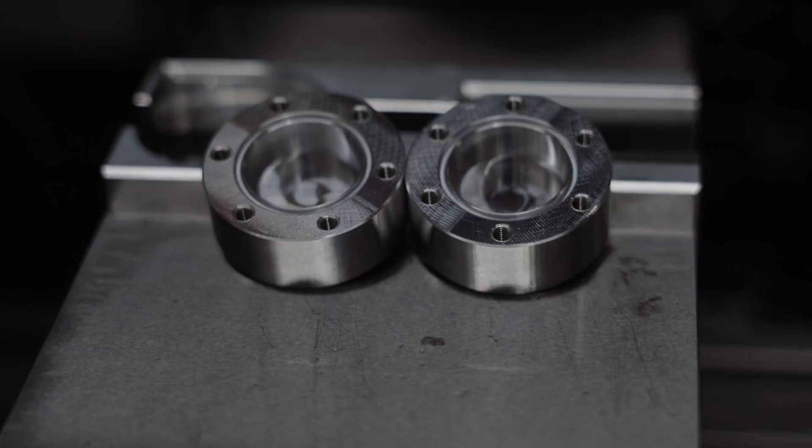So why do I make two parts? The first part came out great and historically I've been happy with the machine, but there's been some issues in arcs that I haven't quite solved. At first I thought it might have been in my actual G-code, but the G-code was running an arc routine, so there's no reason there should have been any issue. If you look on the right though, you will see subtle vertical striations — those are reflections of the fact that it's actually made up of small flat planes. In other words, it's a polygon, not a circle — maybe a 60, 100, or 200 facet polygon, but it's still a polygon, not a clean arc.